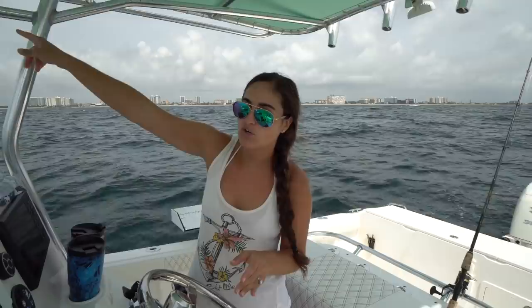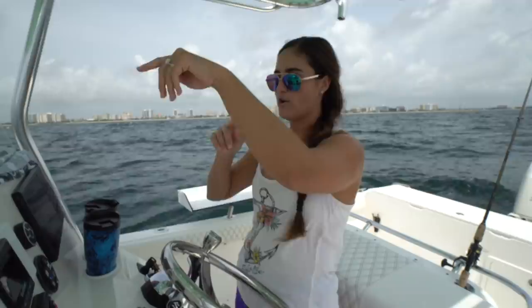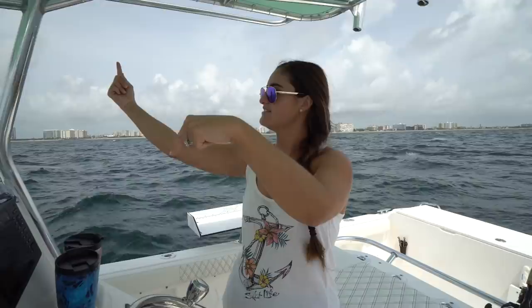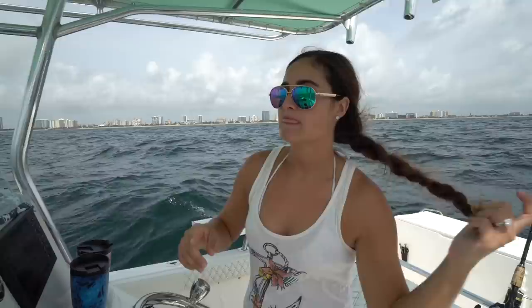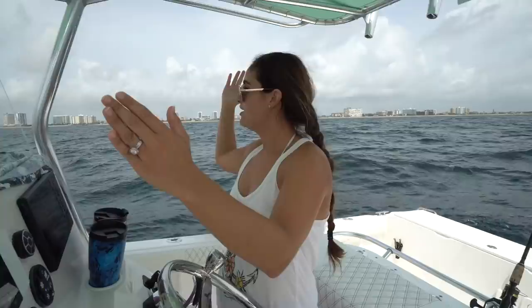Now when I drive the boat, I'm going to make a big circle around the line. If I were to drive straight out, you have the chance of running over your anchor line with the prop, so be very mindful of where your anchor line is. Here's my anchor, here's all my anchor scope, here's my boat — I'm doing a big circle getting way in front of the anchor ball so it pulls it up. The anchor ball is going to go down the line to the anchor, float it up, and then we'll be able to pull in the line. You need a lot of space to do this — don't do this where there are lots of boats anchored nearby or close to an inlet.